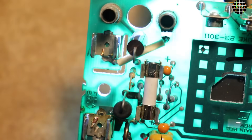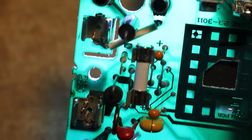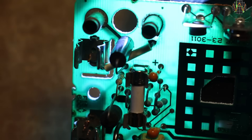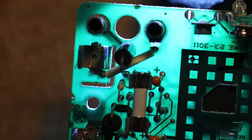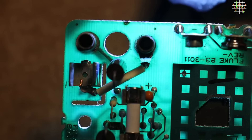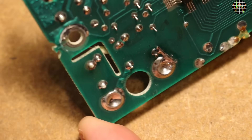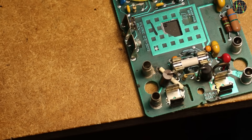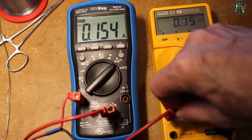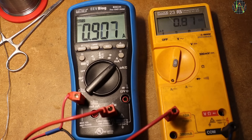Lessons learned. With torchlight illuminating from the back, the gap is clear to see. This makes me wonder about the sequence of events: someone tries measuring mains voltage in the 10A range, the fuse blows, and they bypass the fuse with wire. The same thing happens again — this time the circuit board trace blew because the fuse was bypassed. I soldered a bridge from the socket to the beginning of the white wire, and now there is a connection. Reinstalling the fuse, about 150mA — switching to the 10A socket: yes, it is working. Ramping up to 3A, the Fluke 23 is working fine.